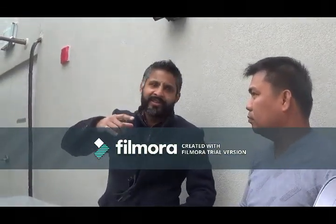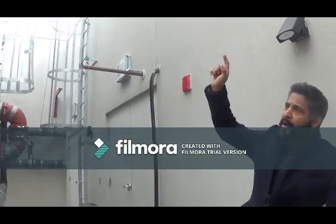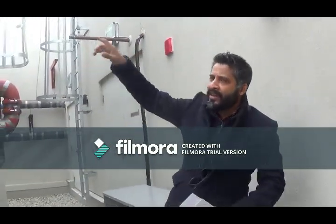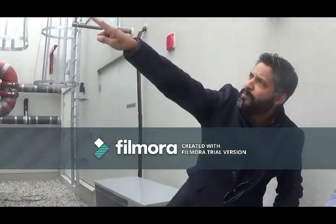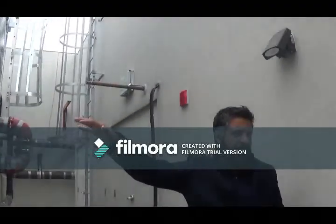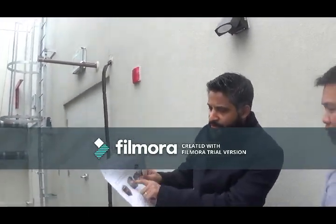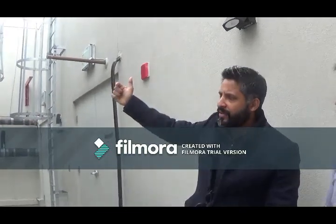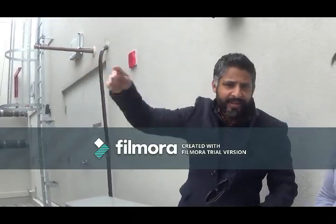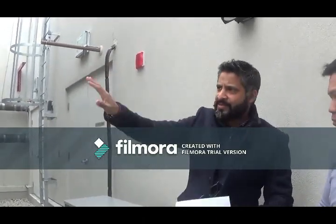So whatever water is there on the condenser side is essentially dumped on top of the tower. It flows down to the sump here. And heat transfer occurs when you see these boarded up things. Those obviously come out at some point when you're putting the unit into operation, and you'll actually see something like this, right? So air goes in from here, air comes in from the other side, there's a fan in the middle, it sucks up air, and the water that is trickling down gets cooled and then it's sent back to the chiller. So that's basically all this.